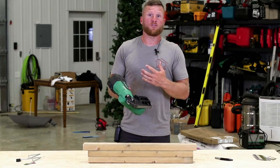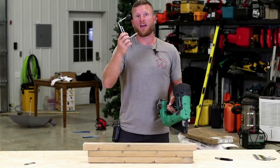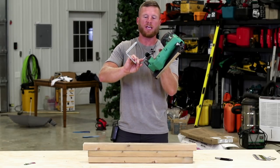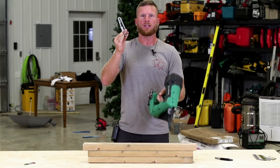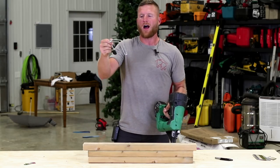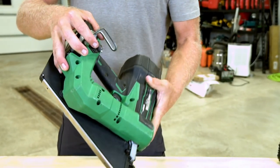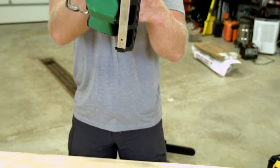A couple of things jumped out at me as negatives on the Hitachi right away. First was the rafter hook — what came on this gun was one of the first things I had to replace. I don't know what Hitachi was thinking, but the original hook barely hooked over a two-by-four top plate. Luckily, you can buy an aftermarket rafter hook adapter, and it was the best thing I ever did — tons of clearance and it hangs on two-by material really well.